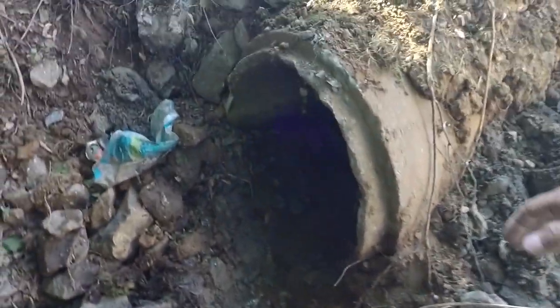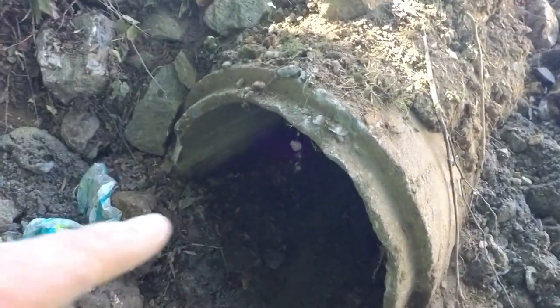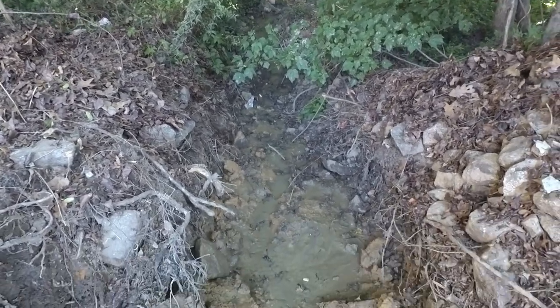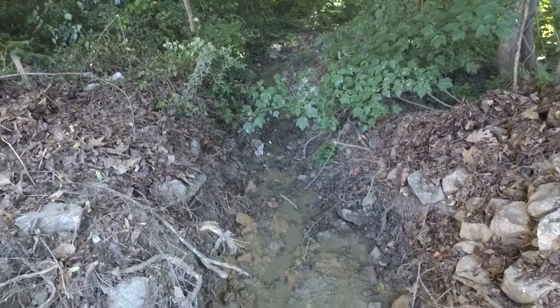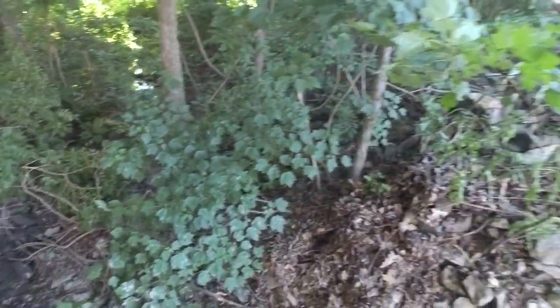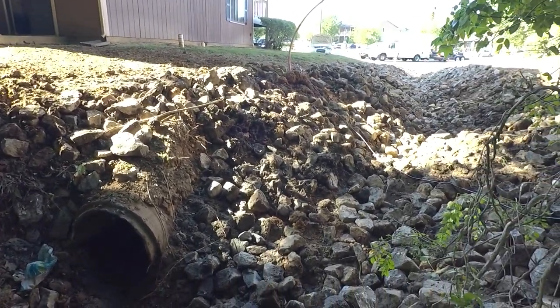Jeremy dug this culvert all out and he said there was a massive river that came out of it. We didn't catch it on film but you can see where it blew all this debris out. In my quote I said I was going to dig this all out and get this flowing correctly as well. The guys dug this out by hand pretty much - now you have water flowing through here. The riprap just couldn't go back in here because it would have done the same thing it did before. Just throwing riprap in a channel is not a drainage solution. Now this thing is actually running where it should be. A bunch of the extra riprap ended up here trying to armor things a little bit.